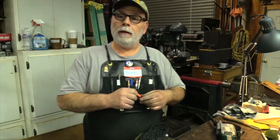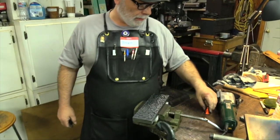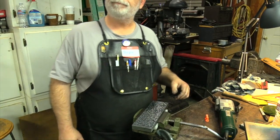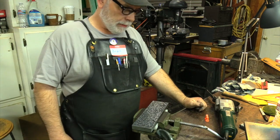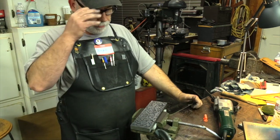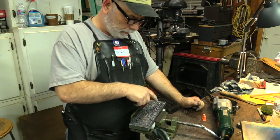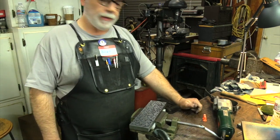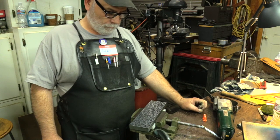You do your piece now. What am I doing? Dive bombing little tiny spots. Dive bombing. You got points on there now. Yeah, so I'm just trying to increase the number of points and go after individual little itty bitty stuff. Okay. And with the power scraper this time instead of the hand scraper. And where are you at?